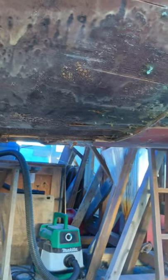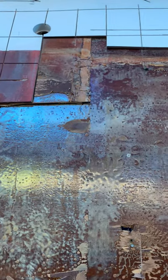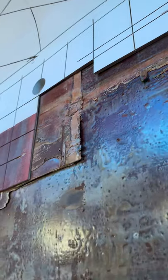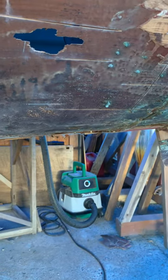This is a void filled area in the laminate. The plywood sheets had been forcefully pushed up on during compounding on the biaxial mold. The edge of this sheet, the entire scarfed edge, was not bonded, and it wrinkled. That material has to go somewhere, so it crushed. And the half atmosphere vacuum that was applied to these layers was inadequate to clamp them together. And the end result is what you see here. So that probably wasn't enough.